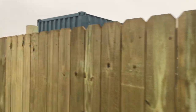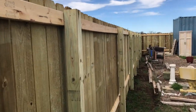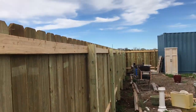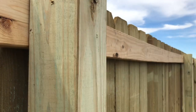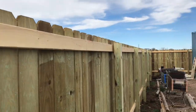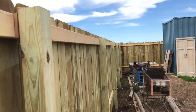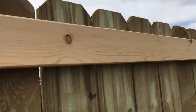When I'm putting these pickets up, I just put one nail on the top and one nail on the bottom to start, then come back and finish it up. We came along here — as you remember, we had the tops of the posts here. I marked each one, basically took my lowest one, and made them all match that. So each one of these is level.